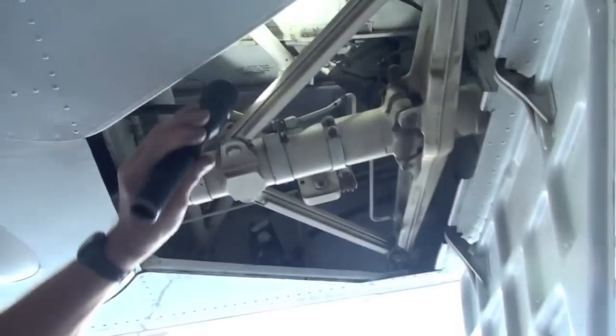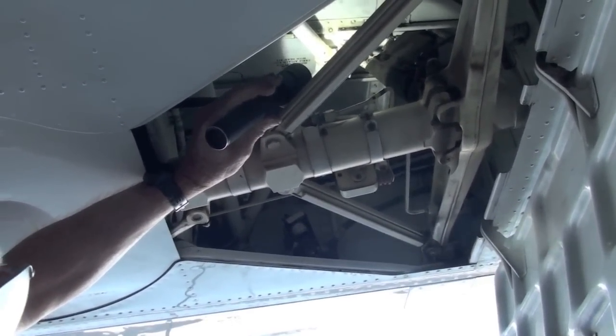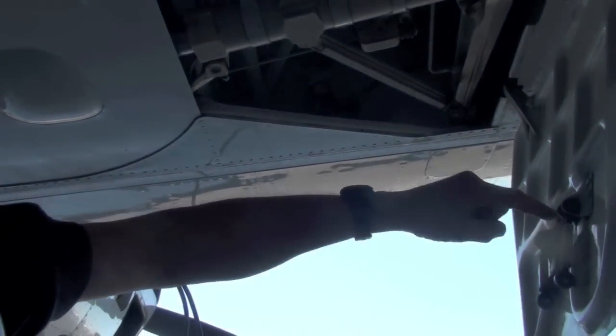All right, that's where I took the grease fitting cap off of. See how close it is to that cable? It's really close. Yes, sir. That's why you don't put them on there. Okay, got it. Door fit looks good. If these bolts are ever removed right here, make sure the heads are to the middle or it will hit the strut right here. Got it. Heads to the middle, to the nose gear.